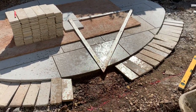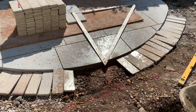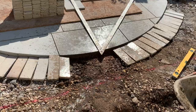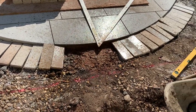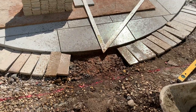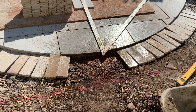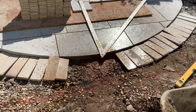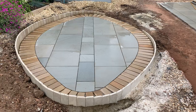Corner pieces have been smoothed off. Now it's time to put the tiles in — I've got my center point and my square. As it's a really hot morning, I like to soak the area I'm about to lay on, otherwise the cement will hit it and dry too quickly and most likely crack. A little tip: when it's really hot, wet it down first.